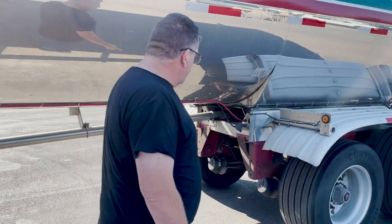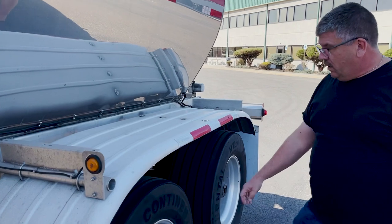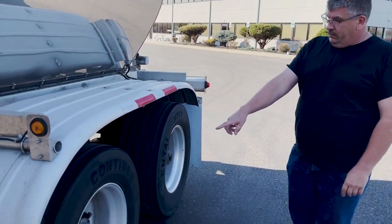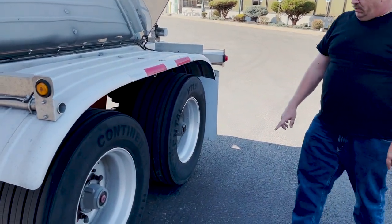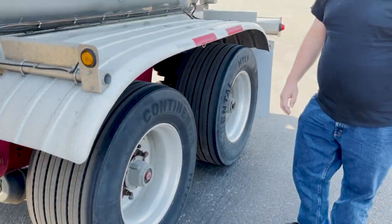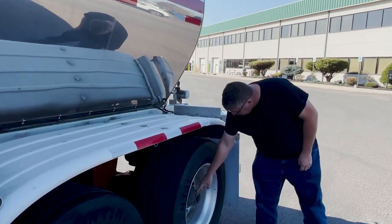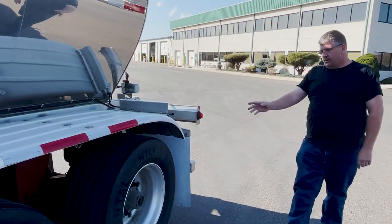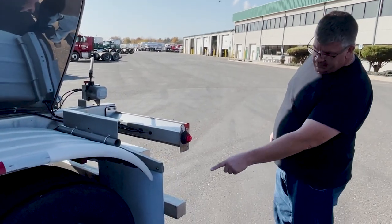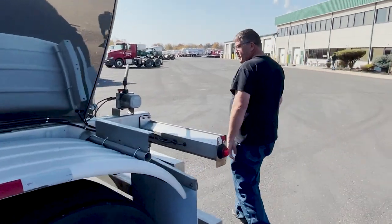As you continue on this side, you still look at your tires, look at the general condition, and make sure the sidewalls are nice and clean with no damage. Look at your outer hub gaskets, and make sure there's no oil dripping or wetness anywhere on the hubcaps, both of them. That's also the inner and outer hubcap seal. This is the outer one, this would be the inner one. Make sure all that looks good and dry. At the same time, if you have clear lenses like on that, you can check your oil level to make sure they're full of oil.